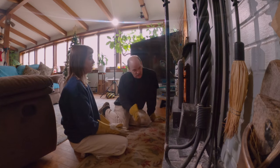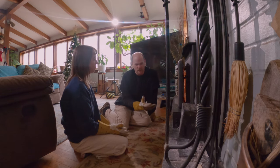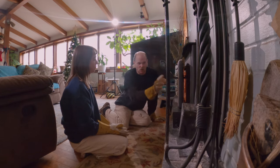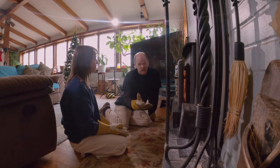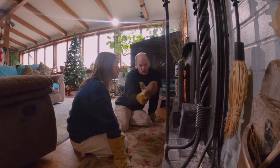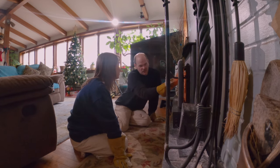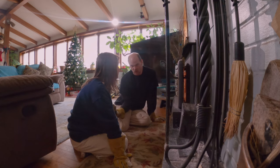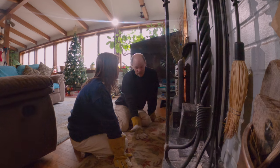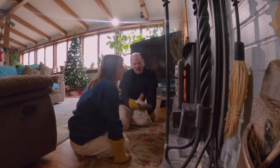So now you let this burn like this for a little bit. And I generally, I don't know about other people, I generally don't walk away with the door open. Two reasons. A, if the door happens to swing open, generally not going to happen. But if a log decides to fall, come and hit the front of the stove, it's going to hit this, knock the door open, and potentially could roll the log out here on fire. Bad problem.